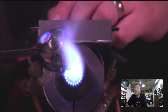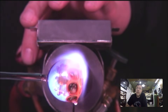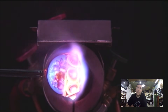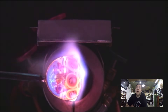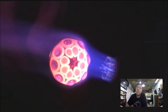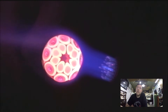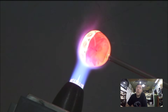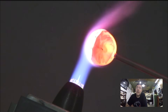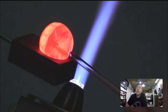Now I'm going to heat it up and melt those in. I want this marble to gain so much heat that all those little trapped air pockets go perfectly round — that tells me there's not a lot of stress locked in there. By heating up those dots and plunging them with a tungsten probe you're abusing the glass, so when those air bubbles go nice and round, that's a good indicator the glass is happy and you don't have unnecessary stress locked in.